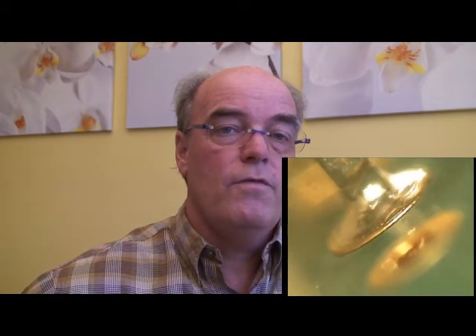In the case of fillet lifting, where the solder fillet lifts from the surface of the pad and is slightly lifted from the pad surface, there is no evidence that solder reliability is affected. However, it is mostly associated with lead-free technology. In the case when the solder fillet wets securely to the surface of the pad and the pad lifts with the solder fillet during solidification of the solder alloy, there could possibly be separation between the pad and a track feeding into that pad on the printed circuit board.